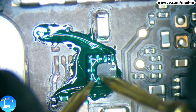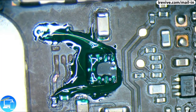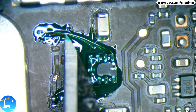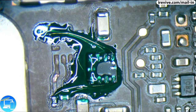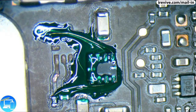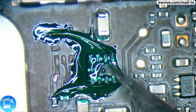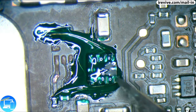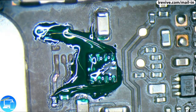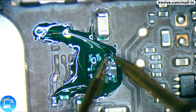And before I close it up, I just want to make sure nothing is touching. And we have our pin 9 and 8 touching again. So I'm going to lift up pin 9 right there, because it looks like that's where it was touching our jumper wire. Okay, no longer touching. So now it's time to start curing this stuff with our UV light. Okay, and just because I touched it one more time, let's check 8 and 9. Beautiful.